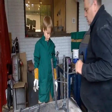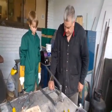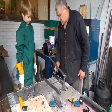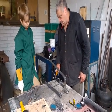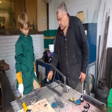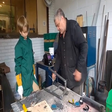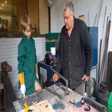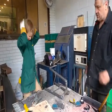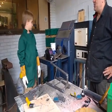Okay, so what I want to do now is if you weld these stretchers on, if you give me the hammer please, if you just do a spot weld but a little bit bigger, you do it on the inside there. On the outside everybody can see, so we're going to maybe try to clean that up later. But if you do inside there and inside there, flip it, do inside there and inside there, you do the stretchers on all four edges, yeah? So, do you want to put the helmet on and do some more welds? Okay, only 6 more welds, I'm sure you can do it.